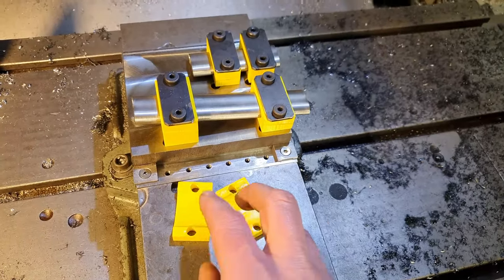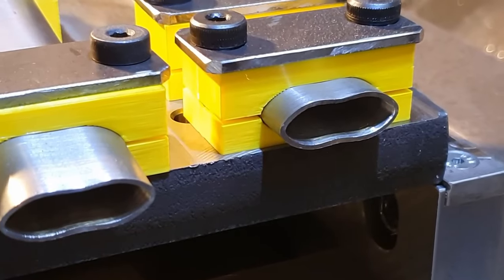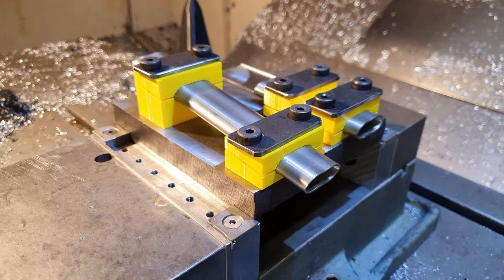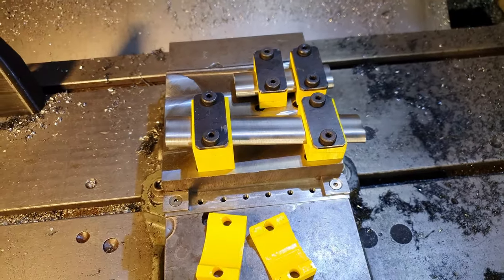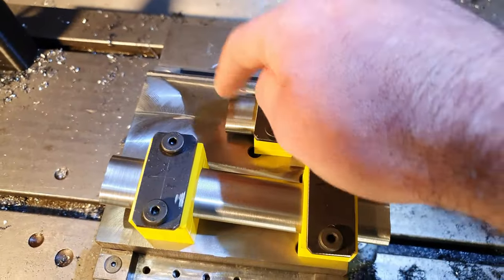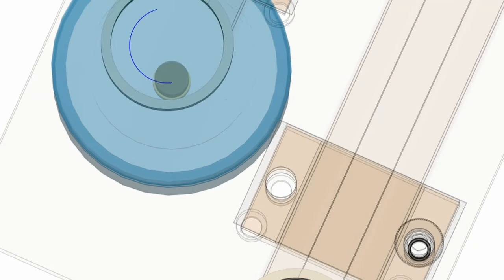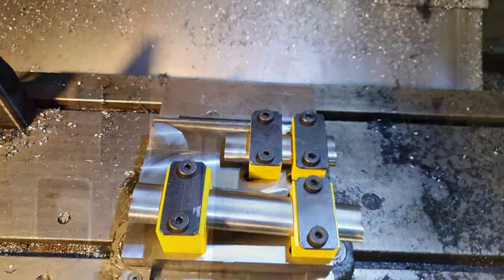And I've got different clamps for the non-drive side tubes. These ones are the drive side, narrower profile. Also, this seat stay front for the drive side is set at an angle. The rest of them are all 90 degrees, whereas this one has got like a seven degree angle to it. Gonna have some troubles though. I won't be able to do this bore because this lot's gonna get in the way of the tool holder and the spindle and whatnot. So I'm just gonna have to do these two and then take that out of the way and do those two.